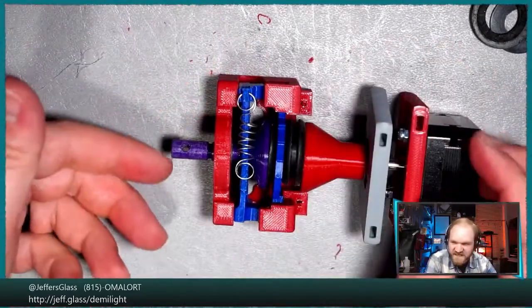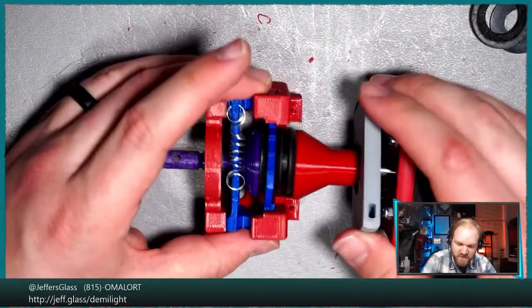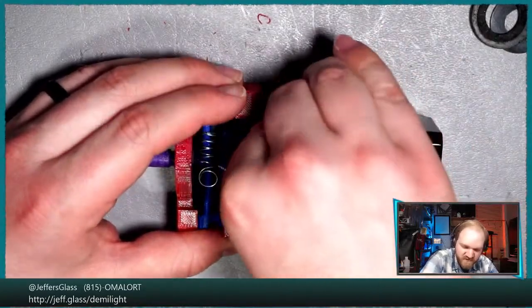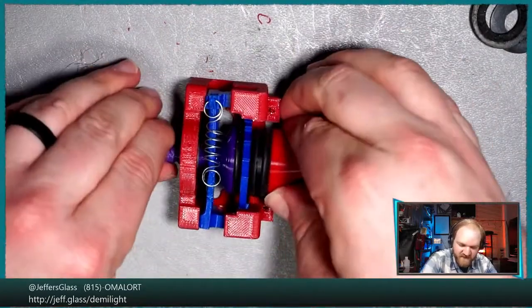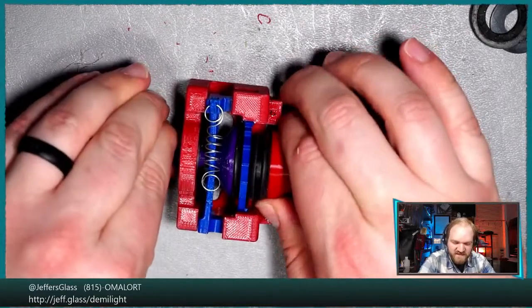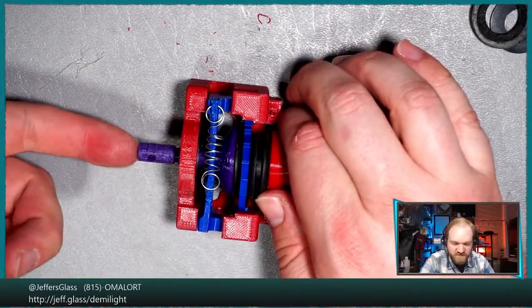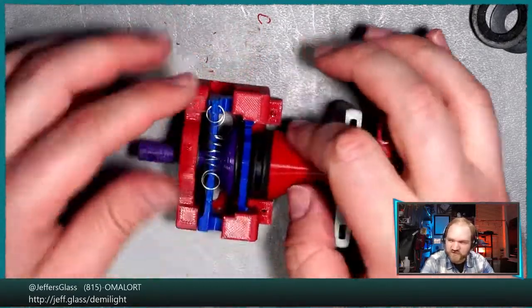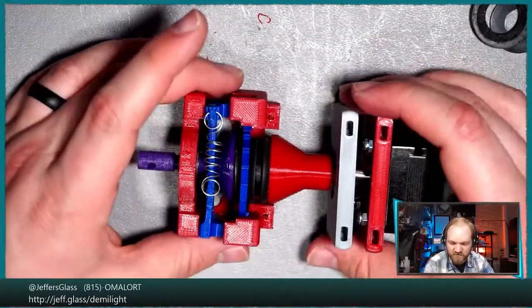And when there is a counter-rotating force on this, when the servo spins slightly the other direction, we will loosen the friction on the ratcheting wheel, and that will allow the arbor to slip a little bit on the friction. That will allow things to lower, but by lowering, those screw threads that are in here will tighten and prevent it from lowering any further.